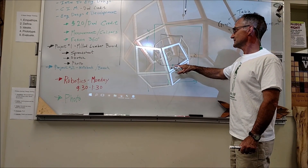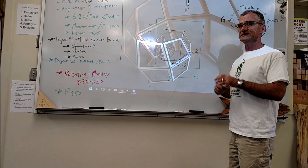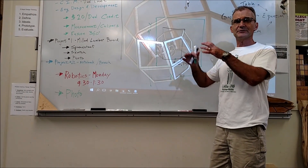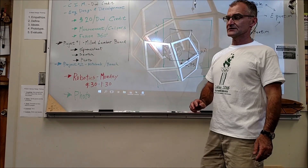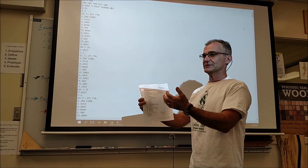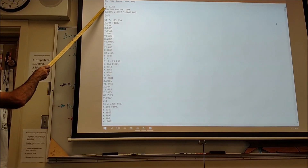From there, you go to the file — it's under my name, Schwartz, under notebook — and it's the final binding comb file. It's an NC file, which means numeric code. I actually created this program in the software called MasterCam and then posted it to create the NC code. I want to take a second to look at the NC code. This is G-code, invented by a couple of MIT guys to run computer-controlled equipment. All CNC, no matter what software you created it in, the programming code starts here — this is always your beginning. Then rapid travel positive 0.255 above your board.